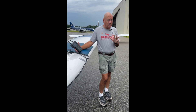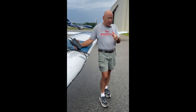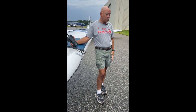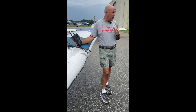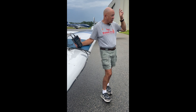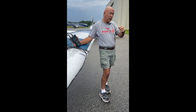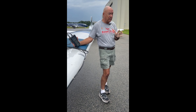In preparing for the run-up, let's talk about safety first because we're going to be messing with some things. Make certain the aircraft is chocked, the pilot should have the parking brake set, we're going to be running up pretty high power, so clear the area in front of the prop — make sure there's no rocks to do some damage. Most importantly, we're going to be changing weights between runs. It's very important, especially on an airplane with magneto switches, that whoever is messing with the prop looks at the pilot and makes sure the magnetos are called off. We're going to have a hot engine with some fuel in it — you go to turn the prop to move a weight and it could fire on you. That's the most important thing.